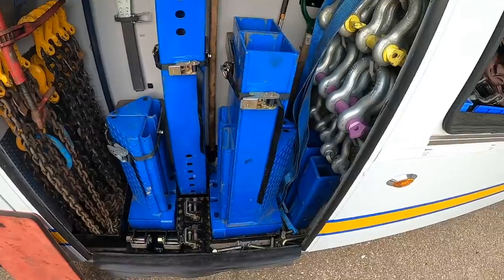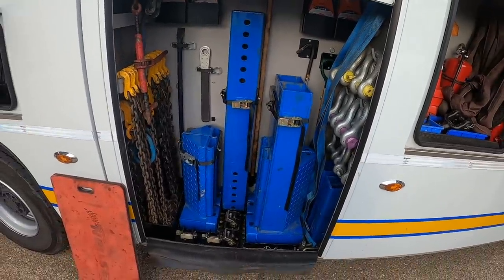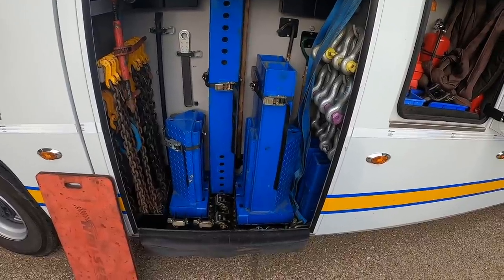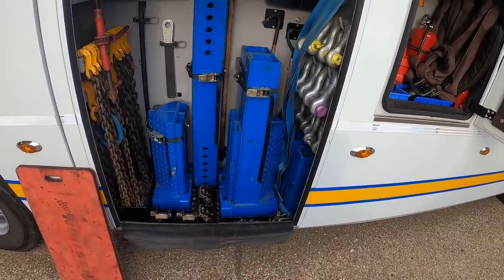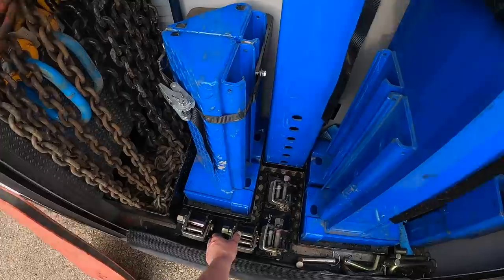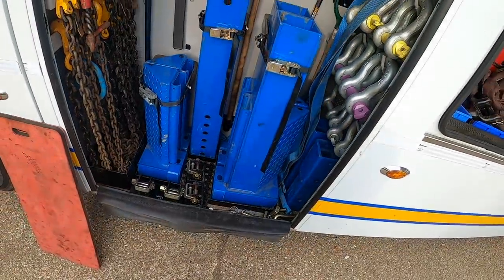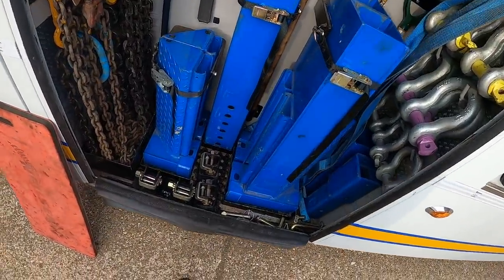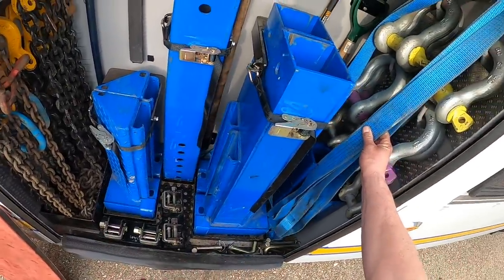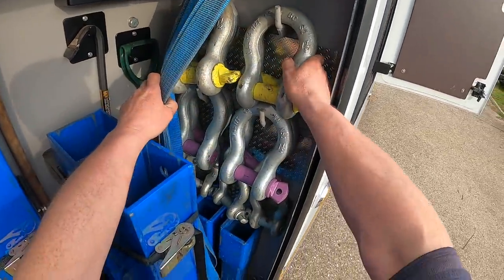These three hunks of metal fit together and they're commercial wheel grids, mainly for coaches that haven't got a beam axle - independent suspension - so you haven't got a lot of strength or many places to put your lifting fork. The wheels fit into a framework and it rides on that suspension. These are little ratchet straps that locate onto the main beam of the wheel frame - we have two straps per wheel on each side.